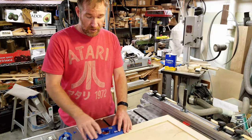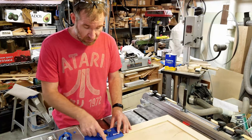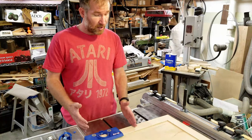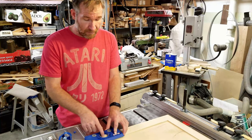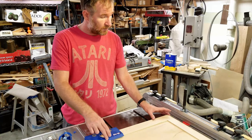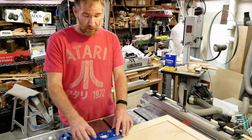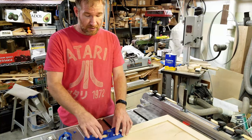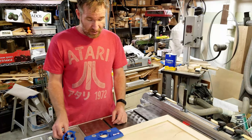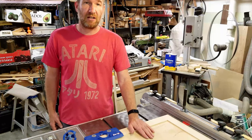Wherever you decide to position the hinge, I'm going to put mine at three and a half inches from the edge, at zero on the center line. For my 42 inch doors I'll put a center line and line it up at zero. For top and bottom on two-hinge doors I'm only going to do three and a half inches, which is kind of a standard I've found on most doors. Use a clamp here and here to make sure it doesn't slip, and push it firmly against the cams to get the right distance from the edge. Once drilled, this door will essentially be ready for finish sanding and then painting.